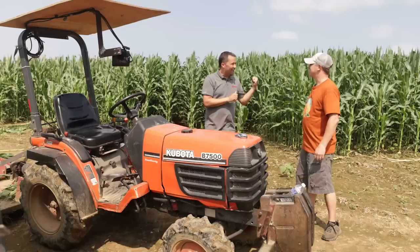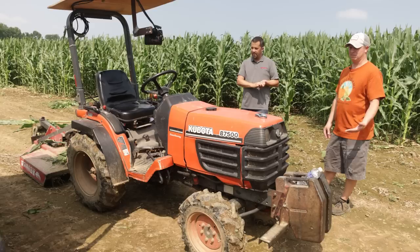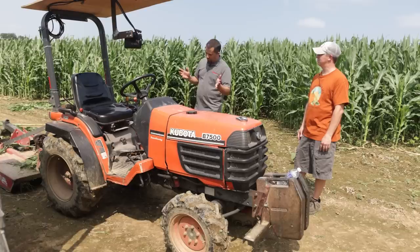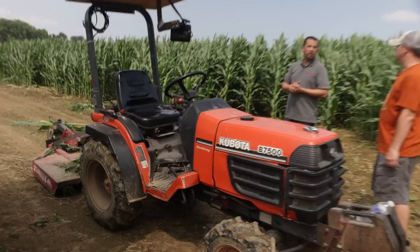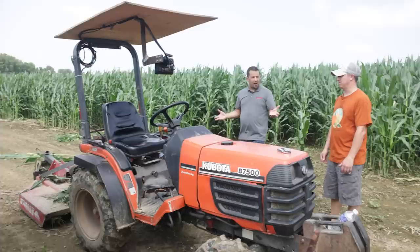Brett, I followed you around in the field here while we were cutting some things. Tell me a little bit about your tractor setup that you use to make the corn maze. Basically, we're just using one of these little four-wheel drive small Kubotas with a PTO-driven 40-inch brush hog on the back. Just take it low and slow and follow the GPS. You modify the tractor here a little bit — I see on the fenders. That was mainly so that the corn doesn't get rolled over by the tire, so it pushes it out of the way rather than trampling. Fairly standard compact tractor setup.